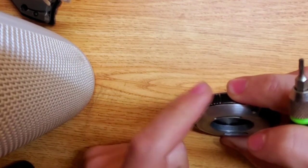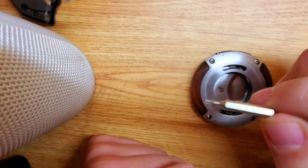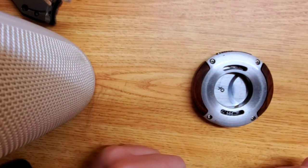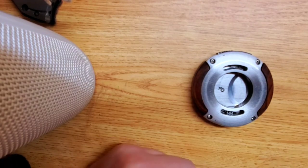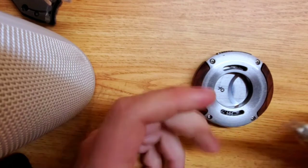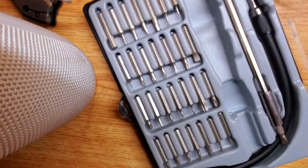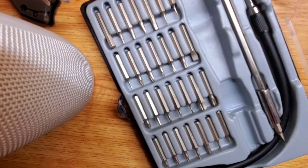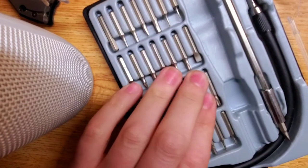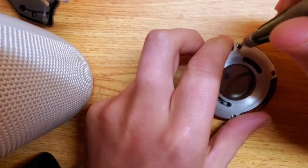On the front side you'll notice the trigger button is on the left, the writing is there, no springs. We can remove these screws. To do that you need a T6 bit. I have a little Harbor Freight set you can pick up for less than five dollars that comes with all your Torx screwdrivers, flatheads, Phillips, hex drives, and even an extension bar and a flex drive. The flex drive is extremely handy — I would pay the entire price of that kit just for it. This kit goes up to about T25 or T30, but here we just need a T6 or T7.